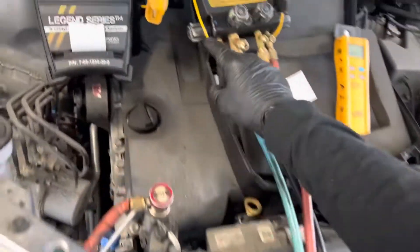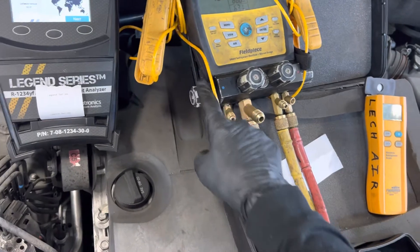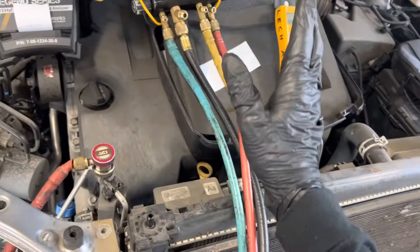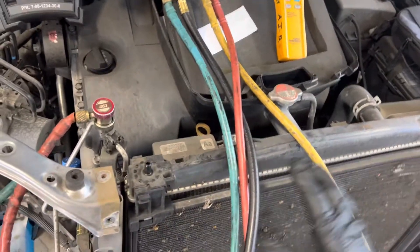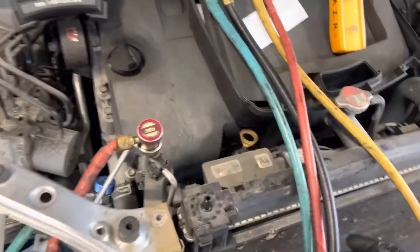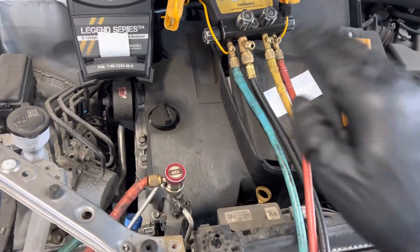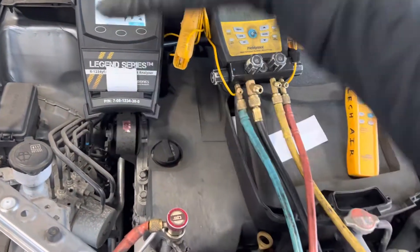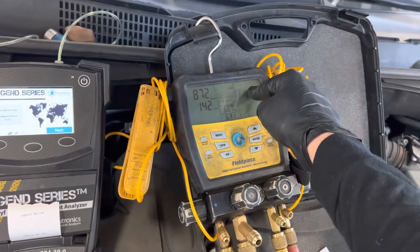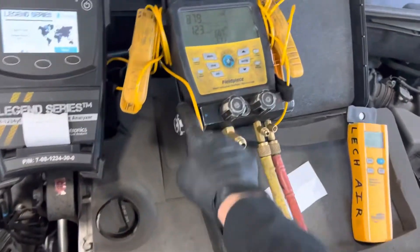Here I go — I'm going to close down the suction side, because I like to flush nitrogen through a system. This is how you should think of it: you're flushing it through to clean out and sweep the system of any contaminants like moisture. I'll introduce the nitrogen on the high side; it'll fill up the high side, go through the expansion valve, through the evaporator, and fill up the low side last. You'll see a higher pressure on the high side when I start, then it'll begin to raise the low side. The low side is now closed.